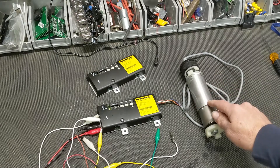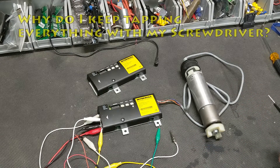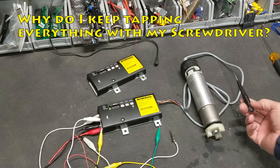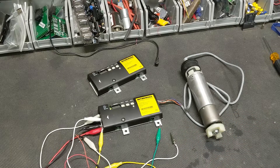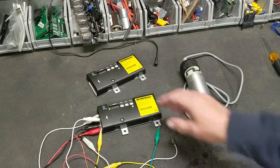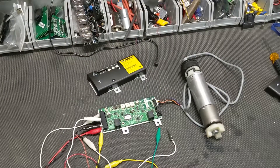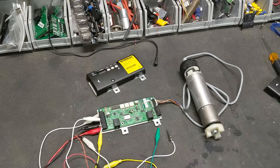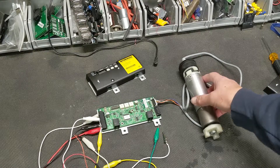The kind of motors these are controlling are brushless motors with sensors. There are two different kinds of brushless DC motors — you can have one with or without the sensors. They use hall effect sensors that tell the controller where the position is at any given time. This is a really good deal if you're looking to control a DC brushless motor that has sensors and need to keep a steady speed or control a project with steady or varying speeds.